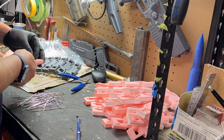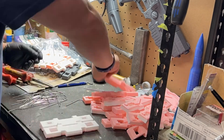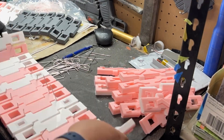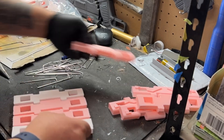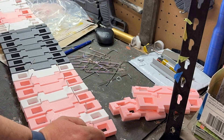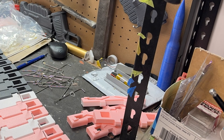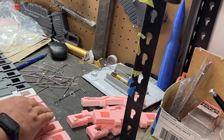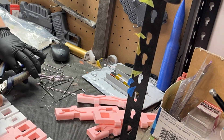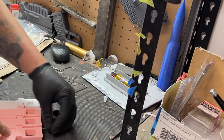The second part I've done so far with this WALL-E build is I've started the tank treads. I wanted to do that because they were a lot of small parts — essentially each side of his tracks has 35 treads, and with the 35 treads there are a bunch of little pins that go in between to hold the treads together and make them replaceable. These were printed in PLA, but I will be doing TPU bumpers on the tracks to give them better grip. I tried the hacksaw and a pair of side cutters to cut them, but in the end I just had to use heavy duty pliers to snip them off. Tracks are done and the body is printed and assembled.